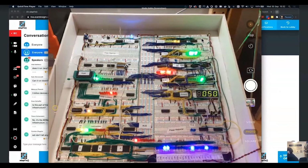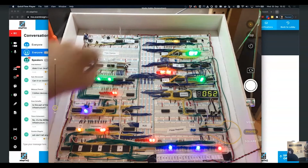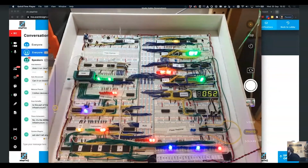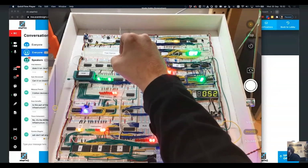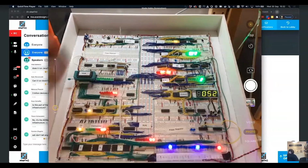And then just to prove it's a real thing and actually programmable, I'm going to pause it for a second and switch into edit mode. In edit mode, I've got some dip switches to set the address. So this is proper old school, early programmable computers with switches on the front. I can then also switch into write mode. I've got a separate set of dip switches up here, so I can actually program. Now this command here is the add to. I'm going to do something simple and say, let's add 3. I'm going to write that, switch back into read mode. You can see it's now showing the add 3 command there. Switch back to run, and continue the processor on.